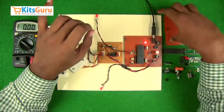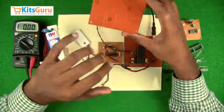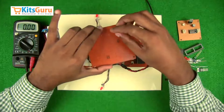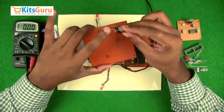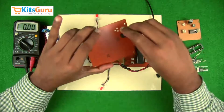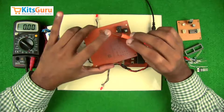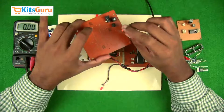This completes the assembly of the LM324 IC PCB. Moving on to the main PCB — first, the power jack, then an on/off switch (no polarity). Then a bridge rectifier, which has four terminals: two AC input and two DC output. While inserting, ensure the positive terminal is on the bottom right side. An electrolytic capacitor is also used — it has polarity: the longer stem is positive. If both stems are equal length, a stripe on the capacitor indicates the negative terminal. Ensure the positive terminal of the capacitor aligns with the positive terminal of the bridge rectifier.